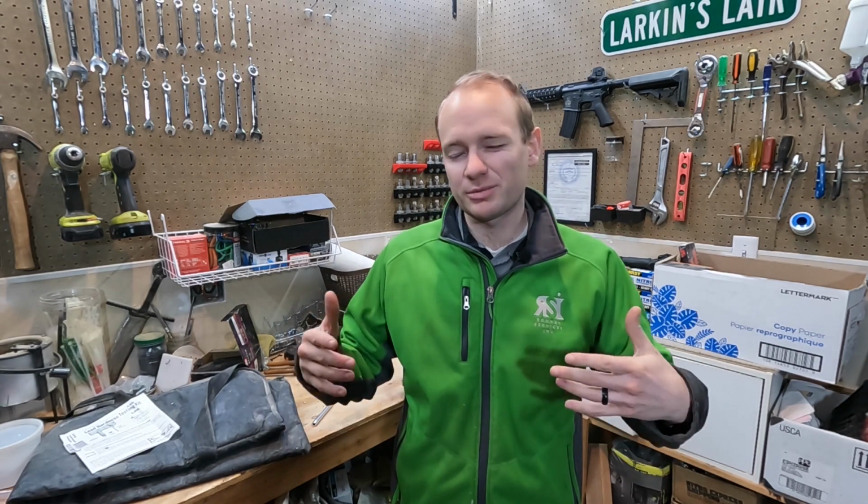So pure lead has a Brinell hardness of about 5. Any lead alloy that you're using for casting will range typically from like 8 to 20. As a general rule of thumb for pistols, I really don't care. Most lead is alloy these days, so typically I found anywhere from like 8 to about 16 with anything that I've picked up from scrapyards, and that is good enough for pistols. I don't even test it, just cast it and send it.